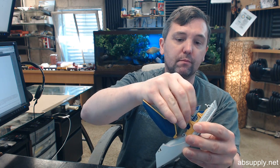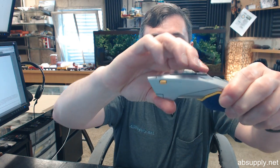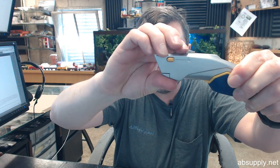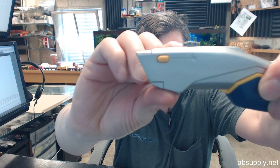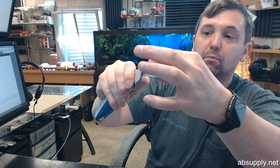Let's remove one and close that back up. Setting the blade is actually quite easy. You can slide that to wherever you need. You're going to put it into the lock position where you can then depress this trigger — you can't depress it in other positions — and that's how you will load the blade into the unit. So you're going to hold that in your hand with that depressed and then slide the blade in. It goes in quite comfortably.